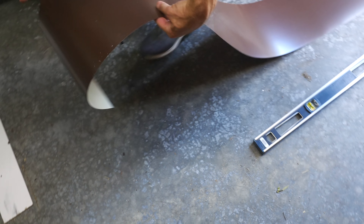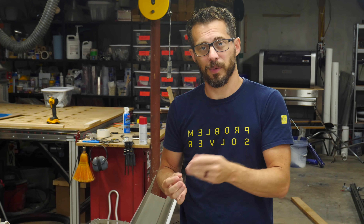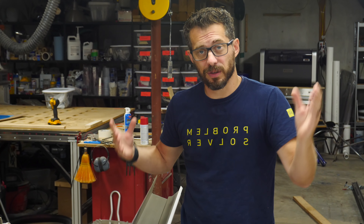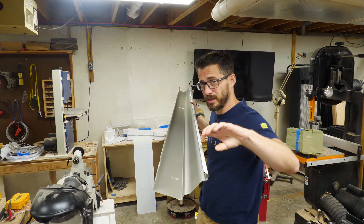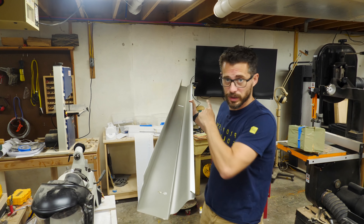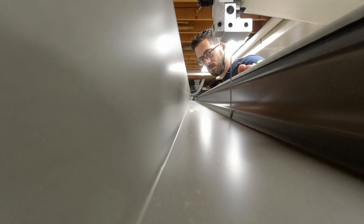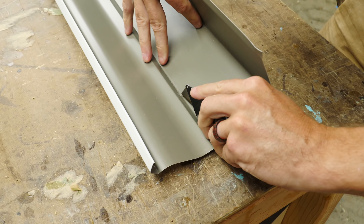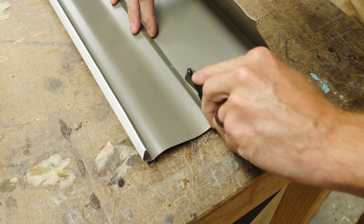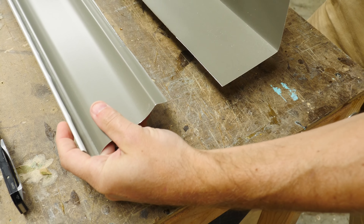The last thing to finish off the doors is to put the aluminum trim around the outside like was there originally. I got a roll of flashing and tried to fold it into a 90-degree angle but it just didn't work very well — I wasn't happy with the quality of the fold because I don't have a really long metal brake. So I went and looked for an alternative and found gutters. This stuff is thin enough that you can cut it with a utility knife — you score it in both directions and it'll pretty much just snap off. But since I have long runs to do, I'm going to use a bandsaw. You can see that this stuff can definitely be cut with a utility knife: just score it a couple of times, fold it back, and it just snaps off.